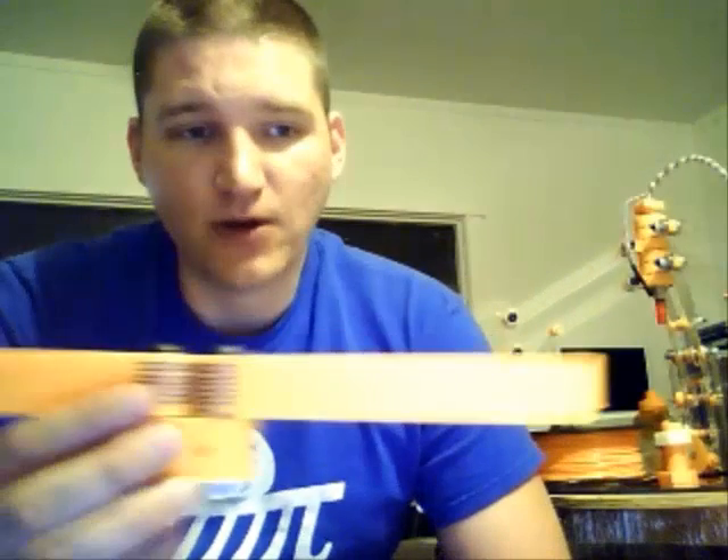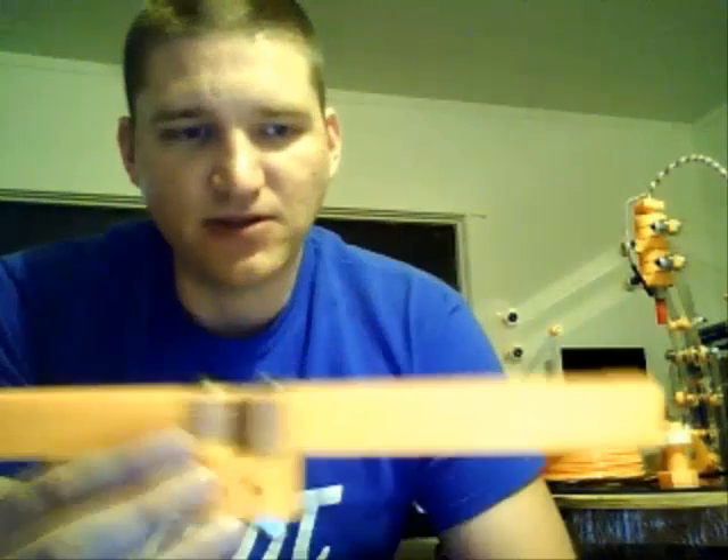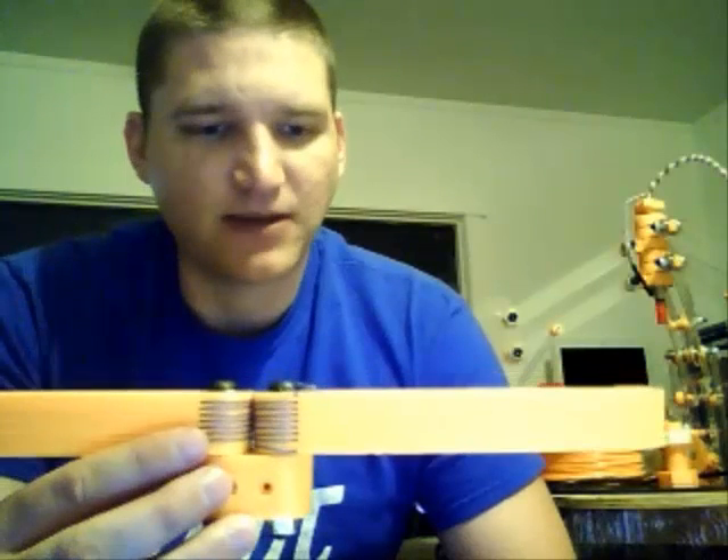As you can see, I'm already moving forward quite a bit with WALL-E's design. Unfortunately, all these parts I just printed out are gonna have to be reprinted, but that's no big deal — it only took about an evening, about six hours to do all of this. A lot of people look at the design and think it's too massive, but the bolts and the bearings weigh more than all this plastic. Very low infill — I'm using 20, but you could use 10 and probably get away with it.